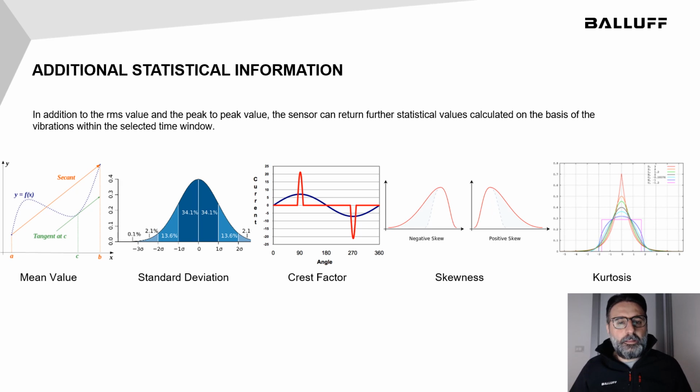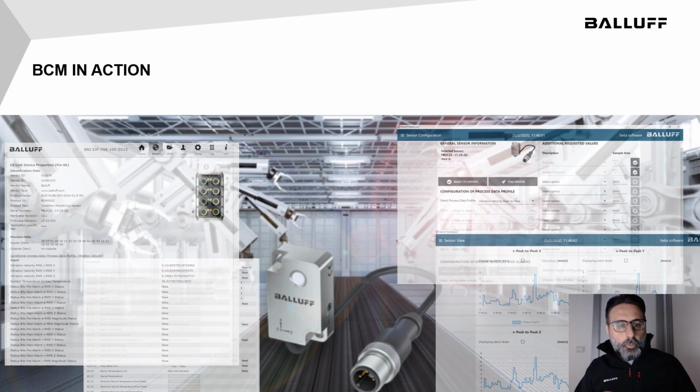Some other statistical values can be returned in output on the process data when the custom profile is selected. These are mean value, standard deviation, crest factor, skewness, and kurtosis. Well, so until now we learned all the basic characteristics of the BCM. So in the next video you will see a kind of tutorial of the BCM in action.